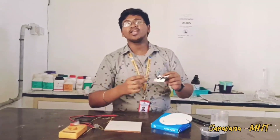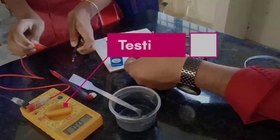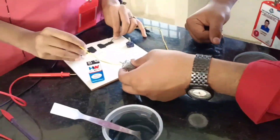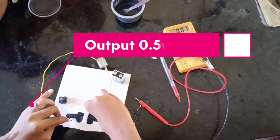Let's take the resistance and the voltage of the paper. We developed a paper battery which is activated by water, aiming to reduce the environmental impact. Anode ink, cathode ink, and collector ink is prepared by charcoal. It is activated by adding 3-4 drops of water and we use cellulose paper as a substrate.